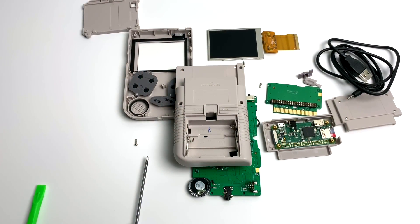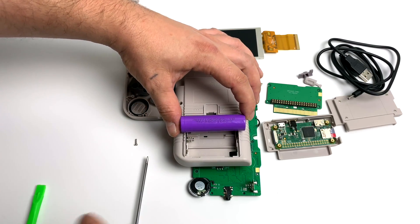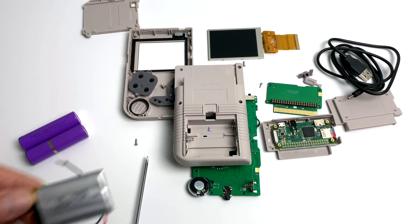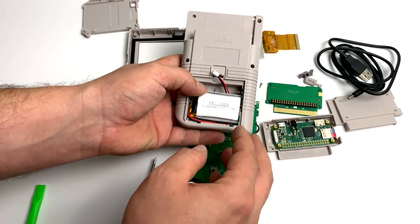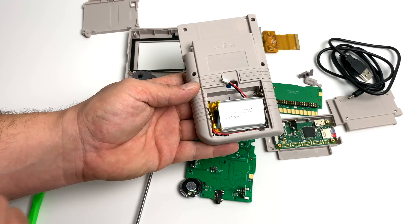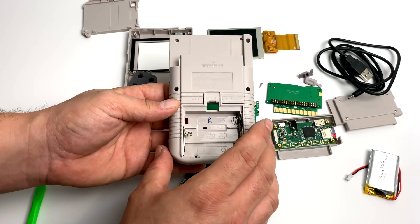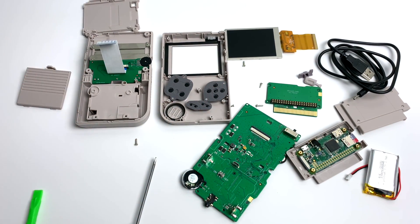I've been planning out my battery modification video and I do have some 18650 cells here. Unfortunately we're just not going to have enough room, but we can use lithium polymer cells. I have a 1000 milliamp hour 3.7 volt battery here and I've also measured the inner diameter of the battery compartment. I've ordered a 3000 milliamp hour battery from Amazon — I have to make sure it fits, but we should be able to get some really good run time out of it. In my initial testing, three AA batteries lasted me three and a half hours, and I expect battery life to be around three to four hours with high quality AA alkaline batteries.